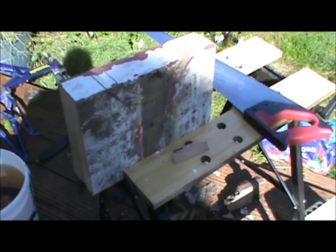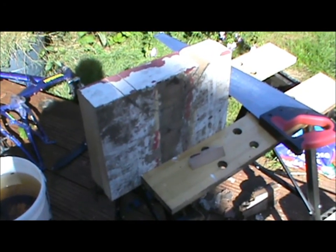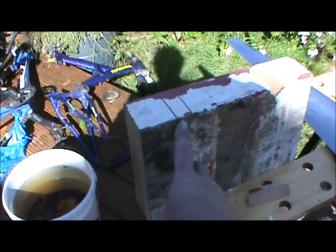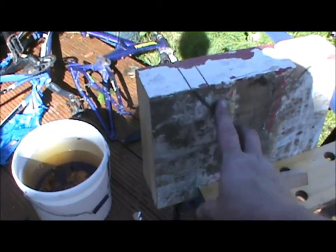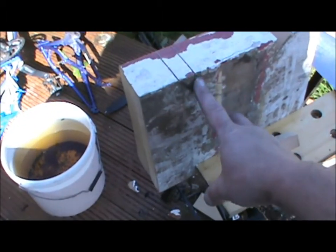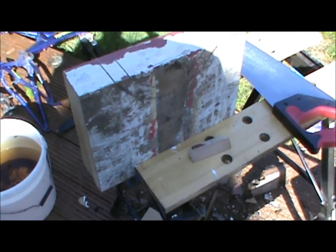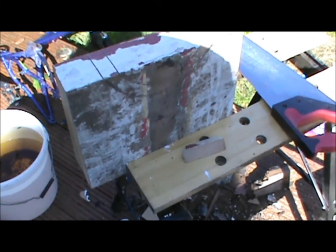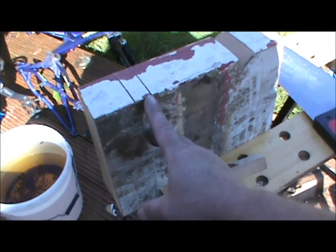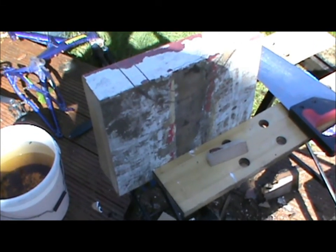This is how we're going to make a very tight curve in a dado rail. I'm starting with a big block of beech that I'm going to make a former out of. I've marked it — it's the curve I want on the outside radius and the inside radius. The difficulty is how do you cut a piece out like that without a bandsaw? Well, with patience and persistence you can do anything. A bit at a time I'm going to cut out the outside radius and then the inside radius, then laminate up some mahogany to make that dado rail.